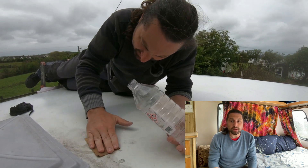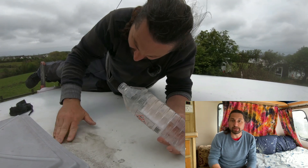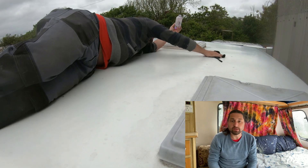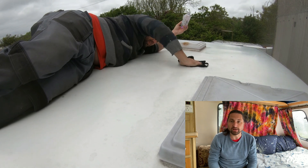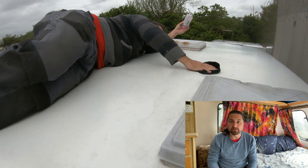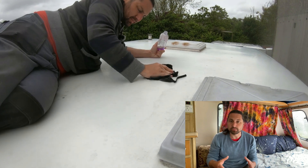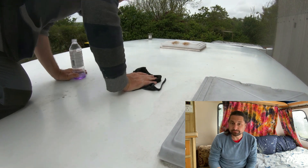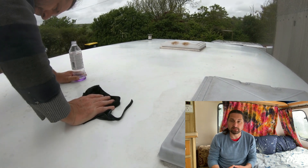You'll notice that the roof area by the bathroom skylight is particularly mucky. I wanted to clean inwards of this area as once the panel is in place it would restrict my access to this area. As you can see the roof colour hasn't been fully restored but I am happy that enough moss, lichen and old paint has been removed to ensure good adhesion. It's important to clean off the white spirit using methylated spirits before applying the adhesive, otherwise a greasiness will remain and the bond will be poor. I didn't fit the panel on the same day as rain was forecast.